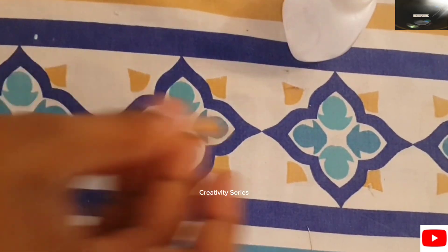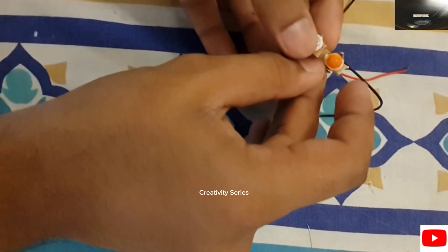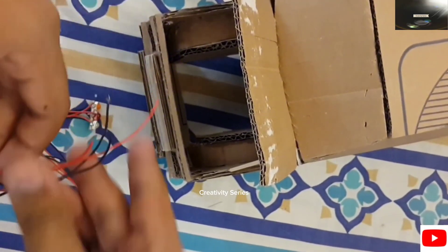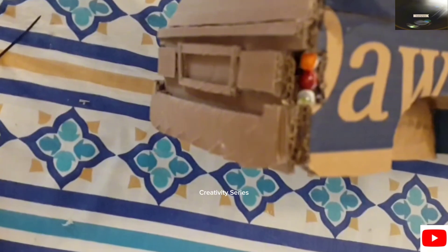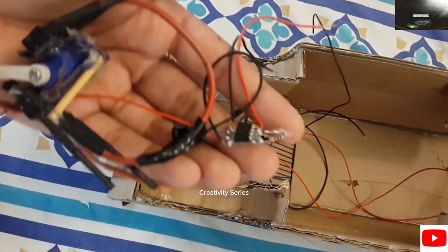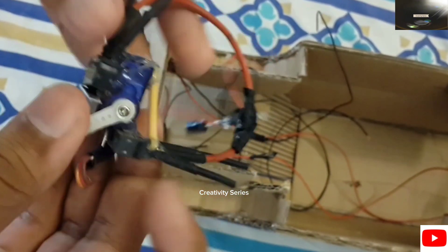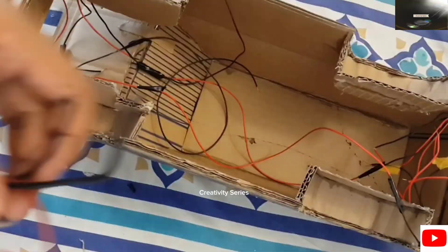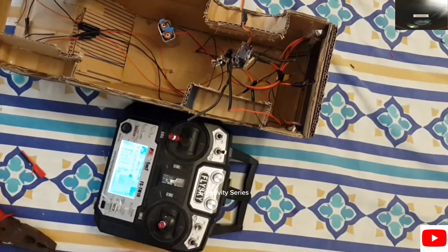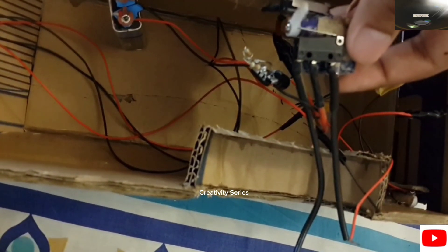Now comes the lights and electronics part. I made some brackets out of ice cream sticks. I'm using warm white LEDs and painted some of them as well, as can be seen. Then I hot glued them. For the rear, I made a panel of three LEDs and glued it to the car shell — same for the other side. For indicators, I'm using my own handmade timer IC circuit, which I made in one of my videos — link in the description. I'm using a servo attached to a toggle switch, one for the left light set and one for the right side. How it works is that the servo hits one of the switches and turns on one set of LEDs, while the timer IC keeps blinking it. Here is how the mechanism looks in working.